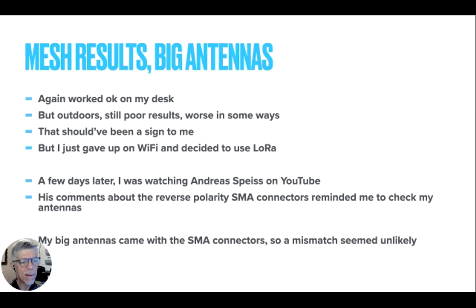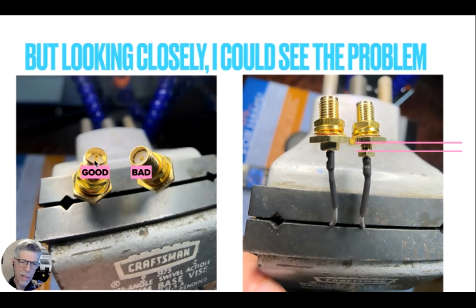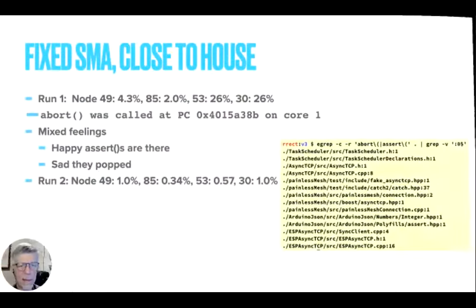But here's the big twist. When I looked carefully at the antennas and connectors I had, I saw a difference between some of the connectors. That's one of the good ones and this was one of the bad ones. Looking at the side, I could see what was going on — the antenna connector itself had come unscrewed. The center of the antenna connector is just a nice little pin, and as that unscrews with a fairly fine thread from the base of the antenna, you lose connection to the antenna. That's what had happened during shipping — all four of my antennas had come loose and I wasn't getting a decent signal.